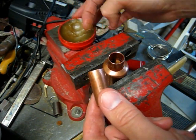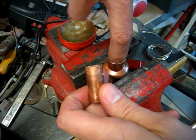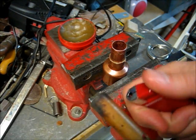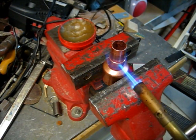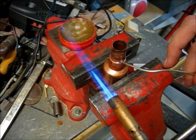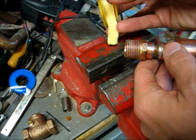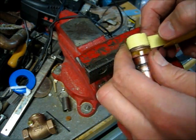To sweat or solder pipes together, first take some solder paste or flux and put it on your pipes — ideally both inside and out if you can reach it — and stick them together. Light your torch and heat up the joint. As soon as it's hot, you'll be able to touch the edges and the solder just flows right in. Do this all the way around. For screw-in pipes, you want to use Teflon tape, or ideally the yellow Teflon tape, which is used for gas. Wrap that around your threads three or four times and screw it into the next piece — the Teflon tape forms a better seal.